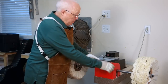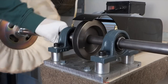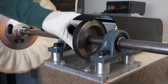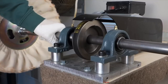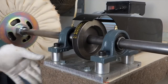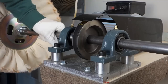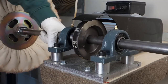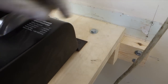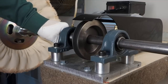The heart of the machine is underneath this cowl. It's got cast iron ball bearing pillow blocks — big ones — a steel pulley that we had made for a one-inch shaft. It's three feet long. This whole deal bolts onto a half-inch aluminum plate, then that bolts onto the base which is made of two layers of plywood, equals one and a half inches thick. We have plans for that so you can make your own. My base is a little bit longer than the plans because I went all the way back to the wall, came across with a 2x4, and lag-bolted into the studs on the wall with four-inch lag bolts. So it's super solid.